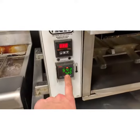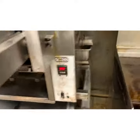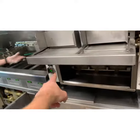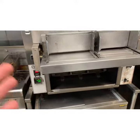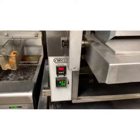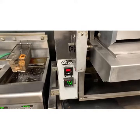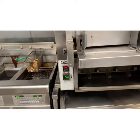She's up and running. Something else I've noticed is that it's set for 720. I'll be shocked if that's the correct set point. You've got to calibrate these every year — you set it for a thousand and let it run for about 45 minutes. Then whatever it hits, you set the set point about 25 degrees lower than that. There's no way this thing hit 750. Most of my other locations are set for more like 620 or 630. So we'll see.